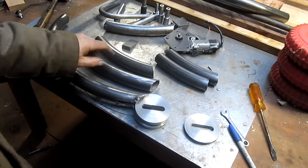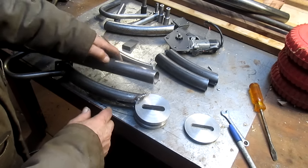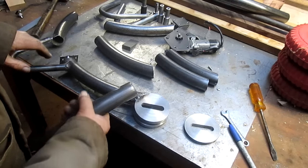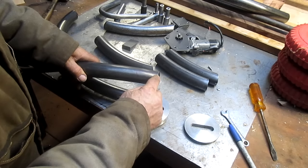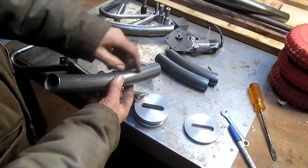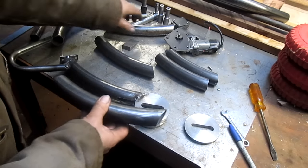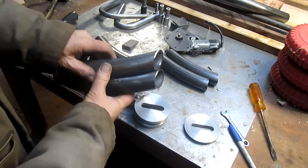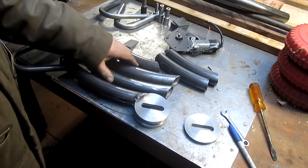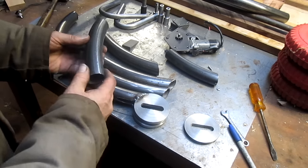I've got the other one of these sitting around somewhere. So what we need to do is come in and cut this groove, and we'll just put it on the mill and mill a slot down the ends of both of those, and I'll go find my other piece. Oh, here it is right here. Yeah, good. Okay, so that'll give us the slots that we need.